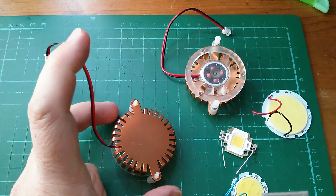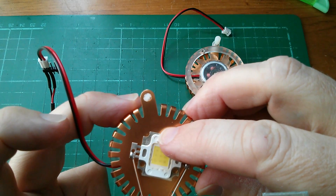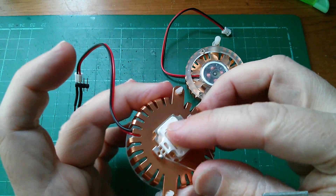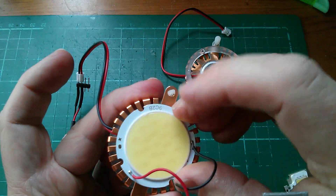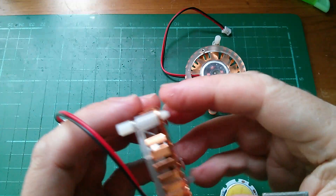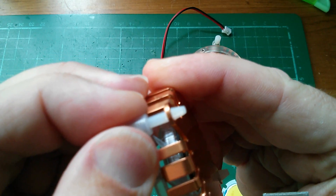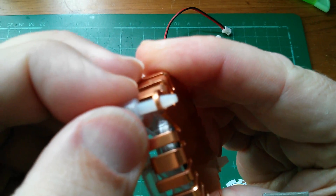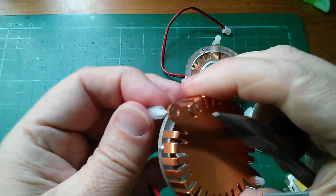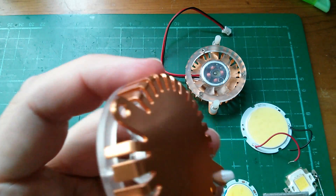This would fit a variety of LEDs — a typical 10-watt LED would fit on there. I'd have to drill some holes and probably tap them. I'll take the fan off in a minute and see how close it gets to the metal. That COB LED fits nicely on there — yeah, I like that. I can see how the springy thing works now: you pull that back and trap it around a bit of metal plate. Alternatively, you can just remove it and use a conventional nut and bolt — that looks like about M3, so that's quite convenient.